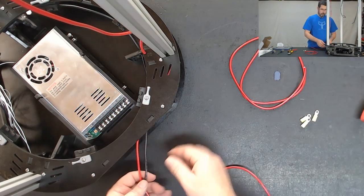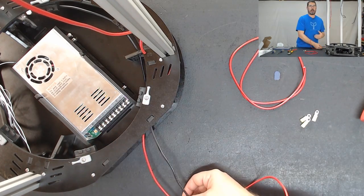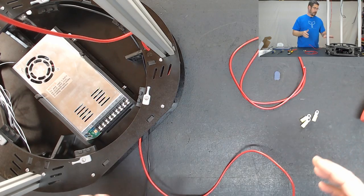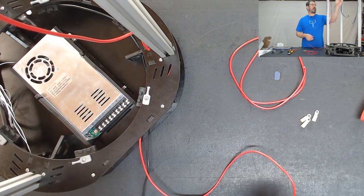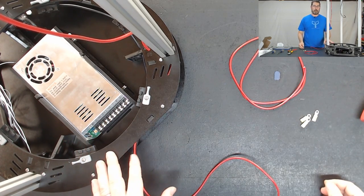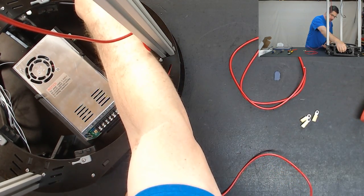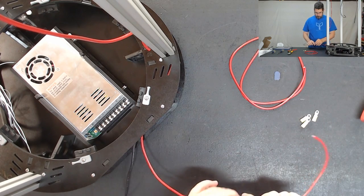If you had nicely laced your wiring through at the end of the last step — the manual really didn't explain how far to pull your wires through. After talking to a few people that have previously built this, they recommend trying to pull it through about halfway; you'll end up with slack at either side. The most difficult one is the thermistor wire, so make sure you have enough room to get that to the board on top. You can trim your wire at the top or bottom or coil it up. My red wire is obviously much longer than the black, so I'm going to trim it up a little bit, to about here.